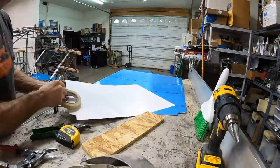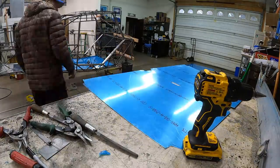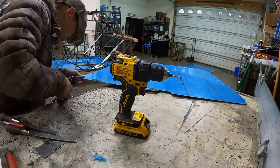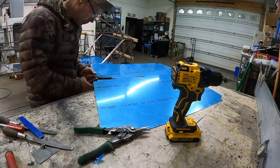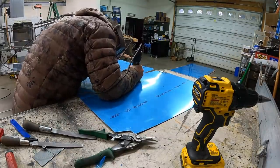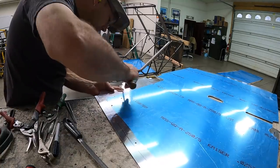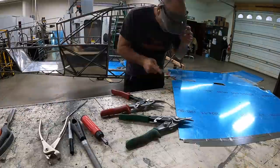As I make these floorboard panels, I try to keep the holes as tight as possible so that less dirt gets down through the floorboards. All the edges are either turned up or have welded-in angle pieces so dirt can't get around the sides and down into the bottom. I did a weighing exercise with a bunch of different materials — anywhere from 0.016 aluminum up to 0.032 aluminum, and then carbon fiber in 0.040 and 0.025 thick, plus honeycomb core sandwich material in both carbon fiber and fiberglass. I know carbon fiber is going to be lighter, but in the end I felt the durability was questionable.